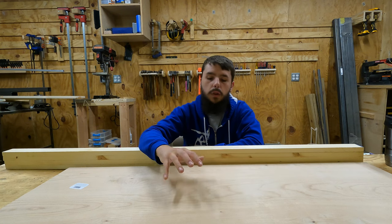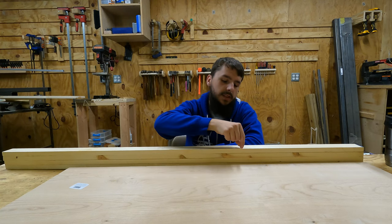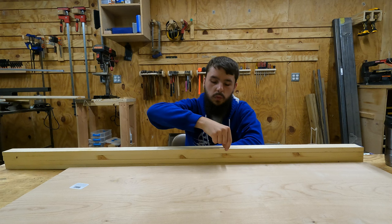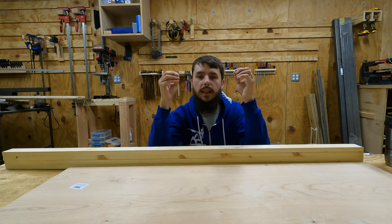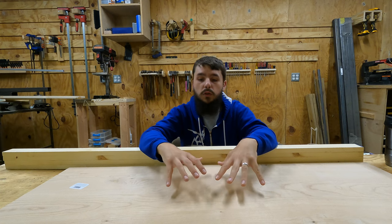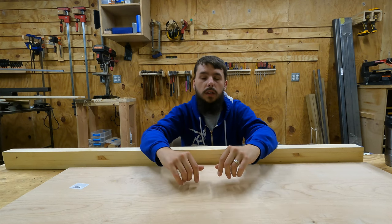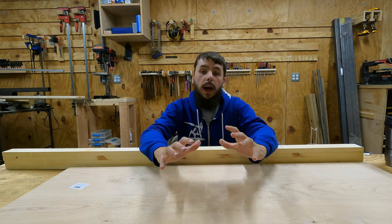And for the drawing surface itself, I'm thinking about just taking, again, where the frame portion is, that's gonna hold the surface. Half inch deep, half inch wide, just routing out along the whole entire inside border of that, so I can just stick that plywood in there. And I'm gonna do something experimental to me. Just use glue by itself to try and hold that together. I think it'll be fine, because I'm pretty sure glue's pretty strong, but you never know, kids can be a little bit rowdy. So yeah, I hope it turns out good.